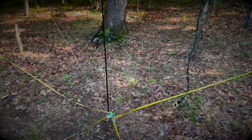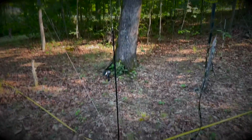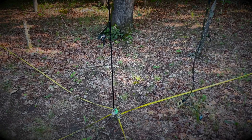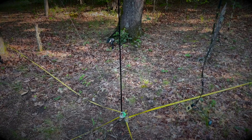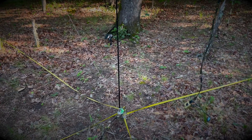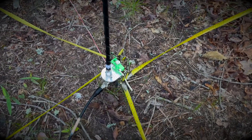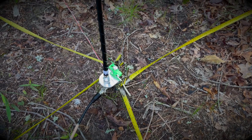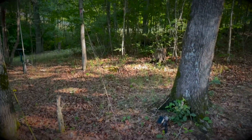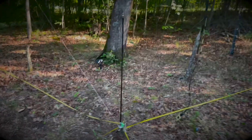It's a hamstick — a 17 meter hamstick. That's what I used. I only run about 20 watts, and I think this hamstick is probably capable of about 100 watts maximum. As you can see, I have an antenna mount anchored to the ground with the radials extending outward, and also a counterpoise going up the tree there, off the ground. Yeah, this is what I use to make contact with Russia.